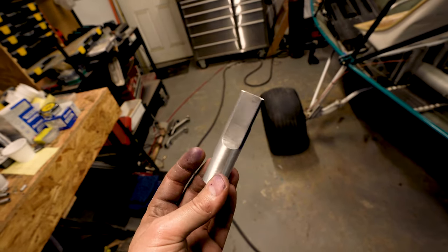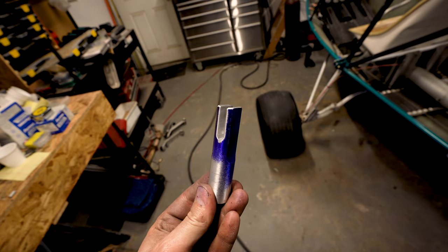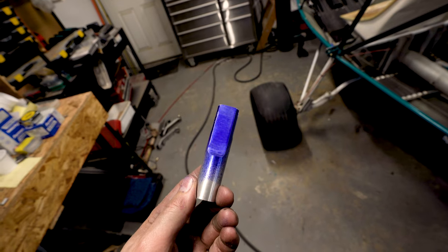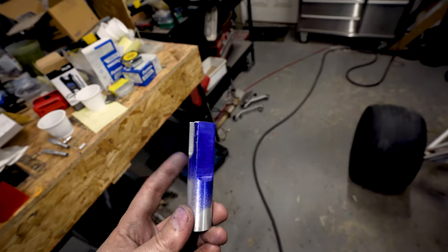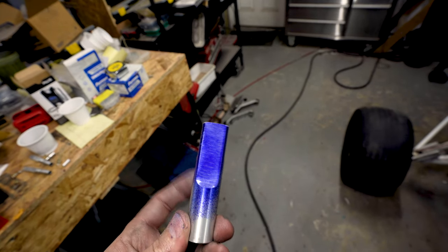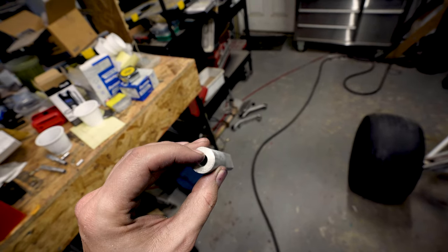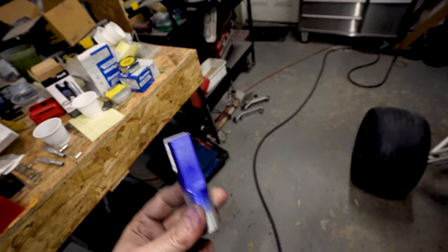And here's the first one of these now. Now I've made the fork here. I've already blued the far side to get ready for the next step of the process, which, much like my other pieces here, is to drill a hole and then round the end on this. Then we'll be back to the lathe doing the center work on it.